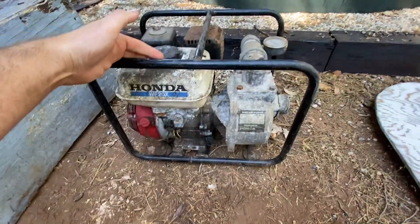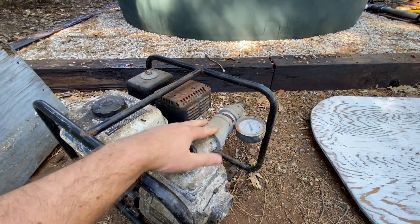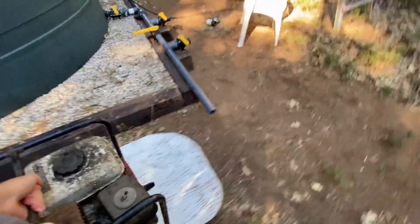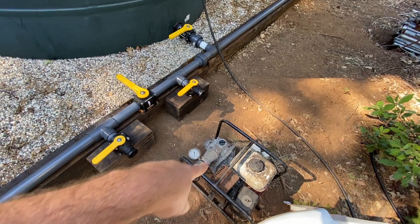Now let's talk about the pump. This is an ancient old Honda water pump that I got for free. As you can tell it is pretty rusty and crusty — I have no idea if this thing works or if it'll even fire. That's probably going to be the next video I make: tearing into this thing, getting it set up, and then getting the fittings on the discharge side and the inlet side plumbed up so they can fit those cam lock valves over there. Essentially a flex fitting goes into the inlet and a flex fitting goes out of the discharge so I can get high-pressure, high-flow-rate water anywhere on the property.